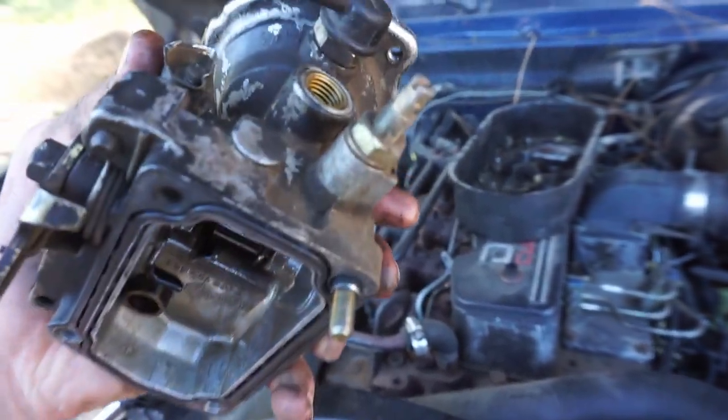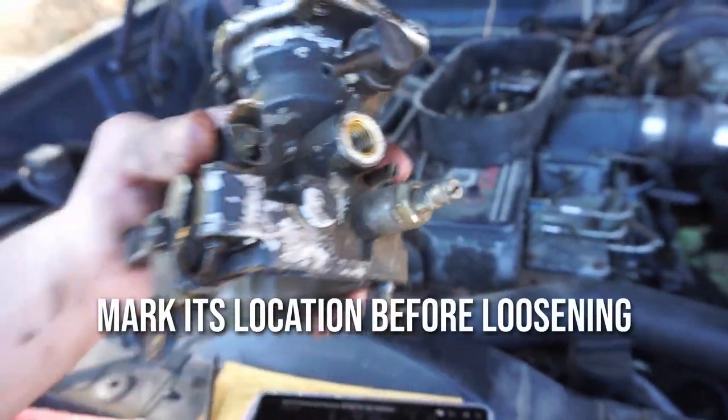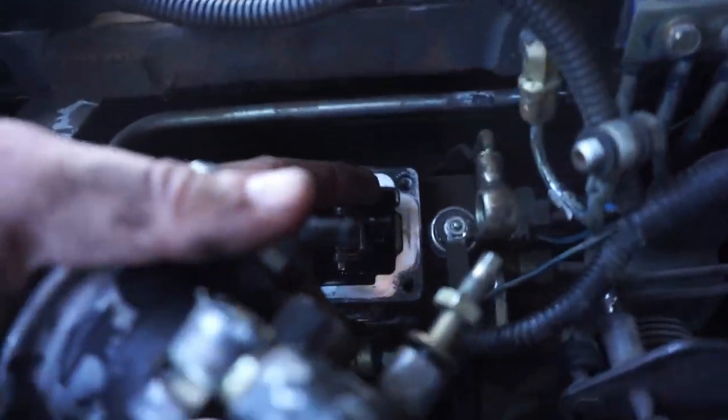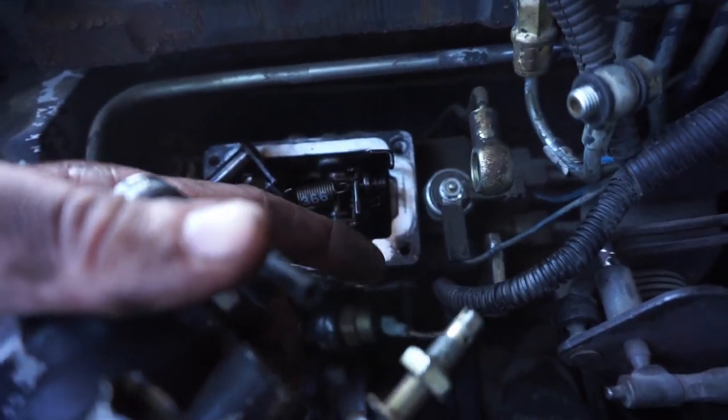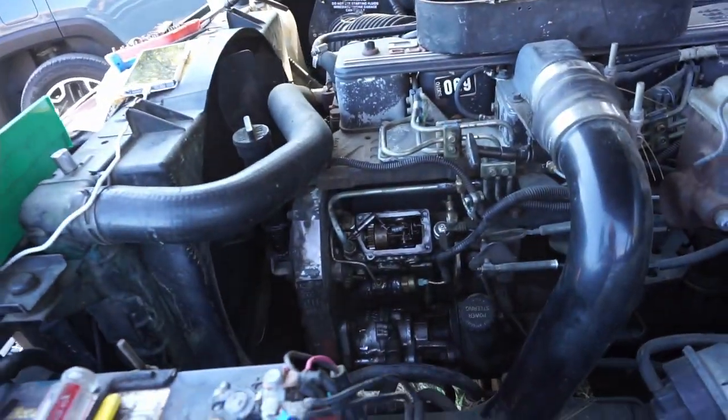So the screw you actually want to back out is this guy. Decent Garage calls it the full power screw. There we go, back that guy out to protect it. It's this fulcrum right here. It's what you're worried about. You don't want to screw down into that fulcrum. You want to put this in there and then thread this in so it pushes against that guy.